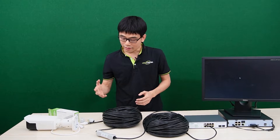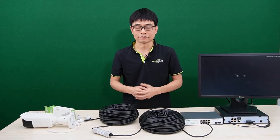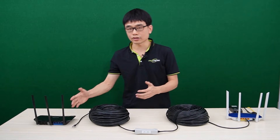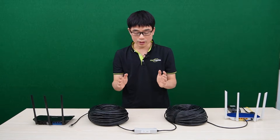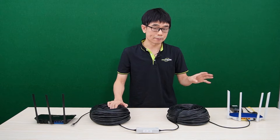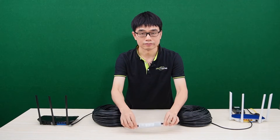There's one more thing — we've been extending PoE for PoE cameras, which require power. But what if we just want to extend the network for non-PoE equipment such as a router? This is the first location — let's say we have internet access here and want to bring the network to a second location beyond 328 feet. With the PoE extender placed in the middle, will the system work? No. This is a regular router — it doesn't provide any power. There's no power passing through the Cat5e cable, so the PoE extender has no way to get power and the whole system will not work.